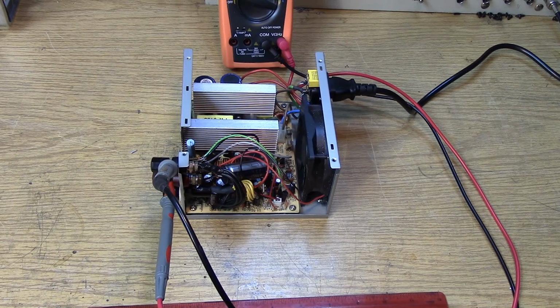And of course there's many more black wires than there are yellow wires, because you need a black return wire for every color, the orange, red, and the yellow. But there's no sense in putting more yellow wires or more black wires. 6 or 7 of those wires is easily equivalent to a piece of number 10 anyway. So you're not going to do much better by using more.